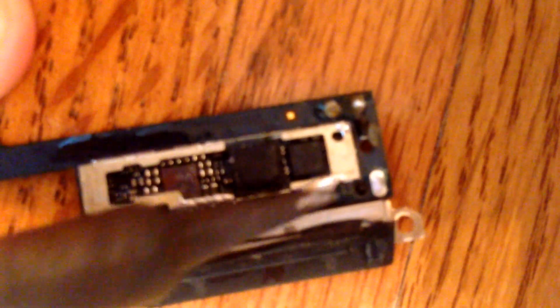You should be able to start seeing it getting a little shinier with this new solder that you're mixing in there. I'm going to add a little bit more flux to it here. A little bit more solder here. That's going to help it mix together.